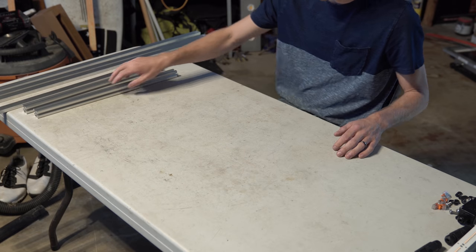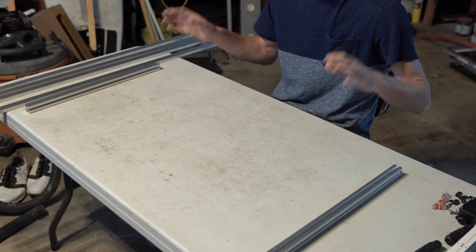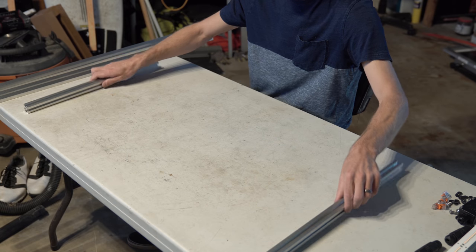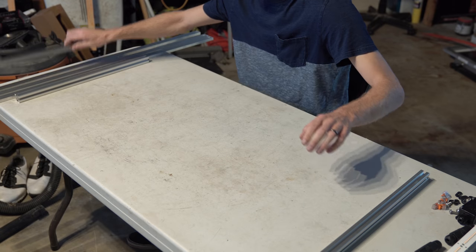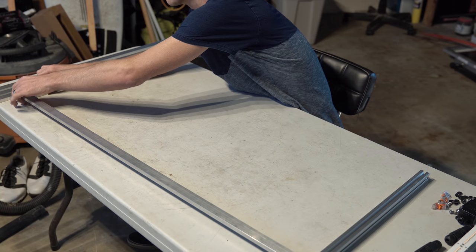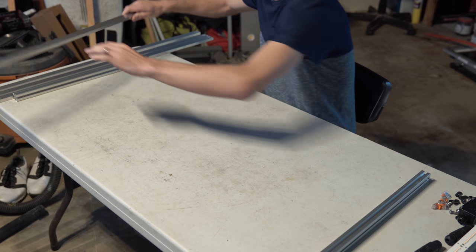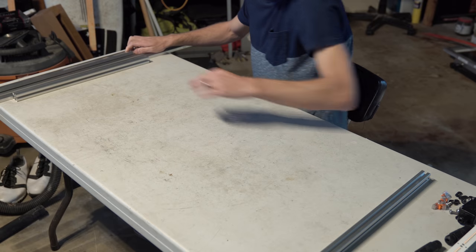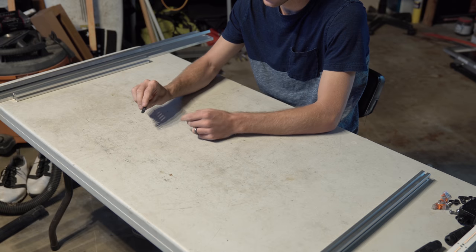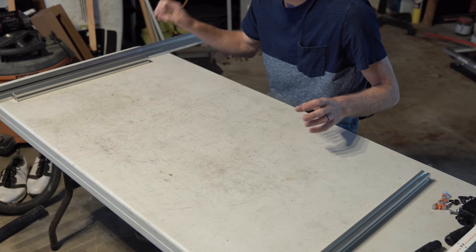So, all right, we're just gonna start off by building the frame itself, attaching the heat sinks to the frame, and then we'll put the boards to the heat sinks and then connect everything electrically. So to start off, we just need to space the 8020 out as best we can. And we're gonna be putting the fin side to the 8020 so that the flat face is facing away to mount the boards on. Now we just kind of space it out roughly so it's there. And then before we get to anything, we are going to feed these little T-nut washers down the 8020 right to where the heat sinks will line up.